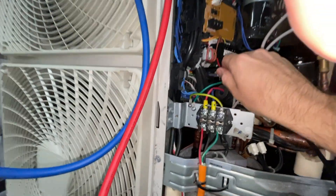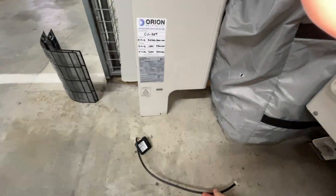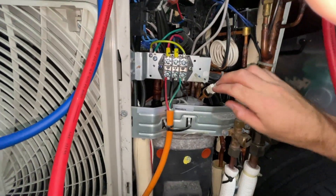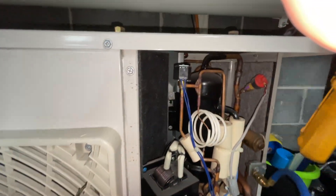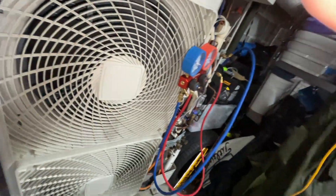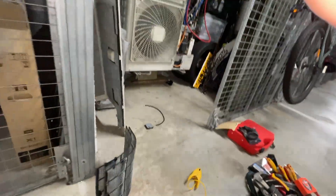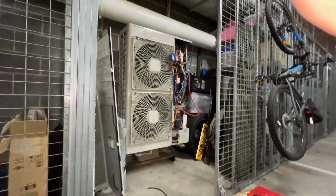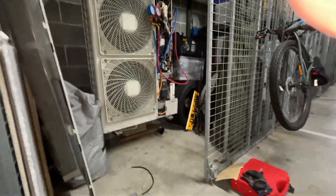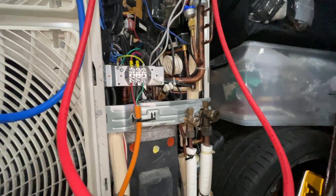Take my little tool off. It's the only way you can diagnose intermittent faults. I've had a job in the past where I did this exact method and it was in fact the high pressure switch that was faulty. People asked why I didn't just take the high pressure switch off and check the continuity — I did do that and it was perfect. That's what I mean — it's intermittent. It only happens sometimes.